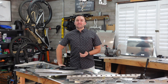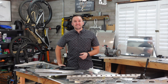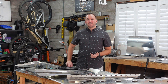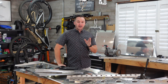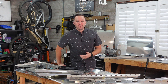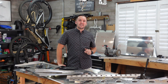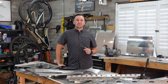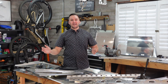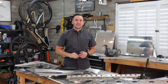That statement goes over a whole bunch of information about laser cut parts — what the issues were, how we got to today, what Vans has done up until this point to assure a quality safe product — and reiterating that those of us with issues with parts would be able to have those parts replaced. It brought a lot of worry to me, especially given other posts in that forum thread about people who have laser cut parts with serious issues — cracking right during dimpling, or the more scary one where people aren't seeing cracks right away, go to rivet, complete a full section, then come back and find upwards of 20% of those dimpled parts having cracks in them.